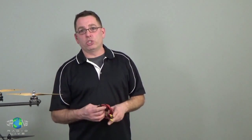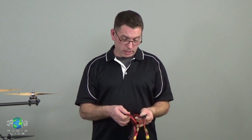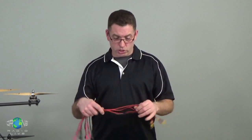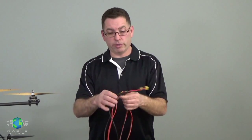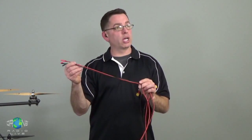He made that up. No, so it's power distribution, taking the power from the battery, from the big thick wires that are delivering the power into the helicopter, and then distributing it through increasingly smaller wires to where it has to go. Now, this is a harness that I had made for a helicopter a while back, and this is another option for power distribution where you take wires and you bare sections of them, you wrap them together and solder them, and then you put insulation around it so that you could plug in your batteries and then run wires out to where, this is when I was mounting motors on the ends of the arms.